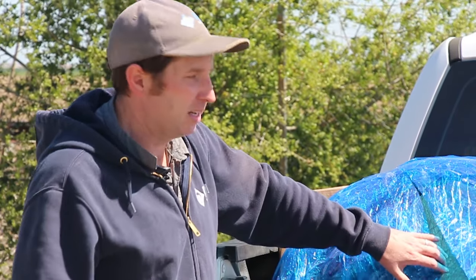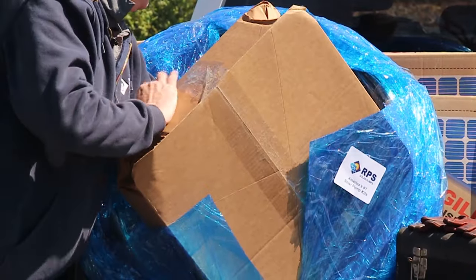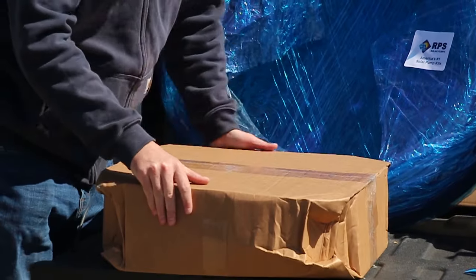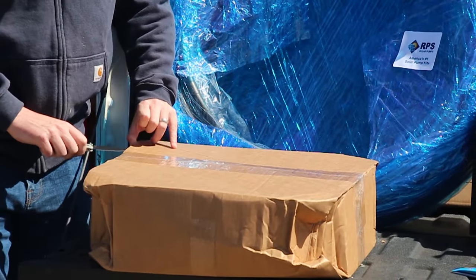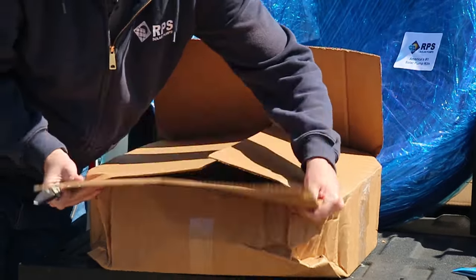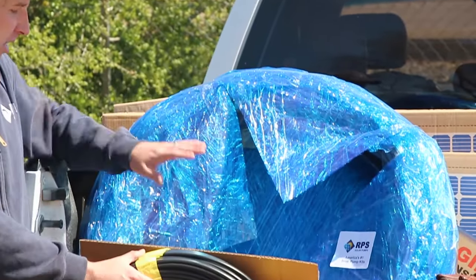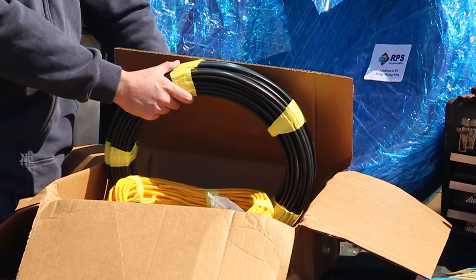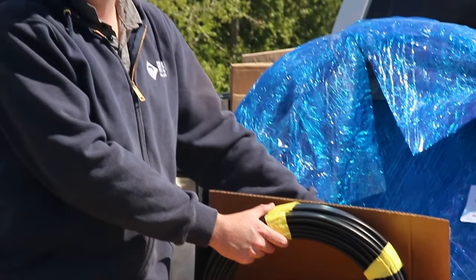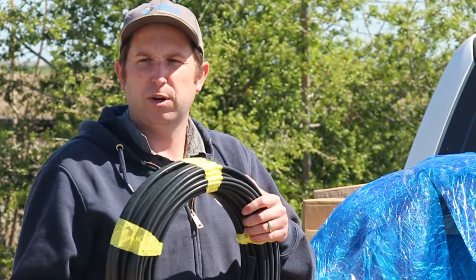Let's cut this open and I'll show you what's coming in the turnkey kit. The turnkey kits come in 100-foot, 200-foot, and 300-foot lengths — they're all pre-packaged and ready to ship to your door. In this case, it's a 100-foot turnkey kit. On the outside we have 100 feet of poly pipe — in this case one-inch, but we also have it in three-quarter inch. Depending on your flow rates, we'll help you size whether you need three-quarter inch or one-inch. Inside is our 100 feet of submersible pump wire.